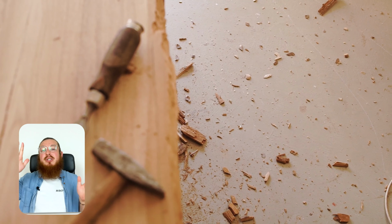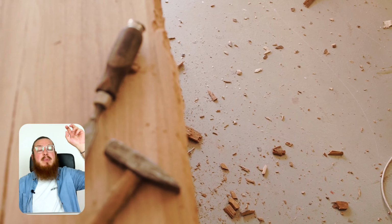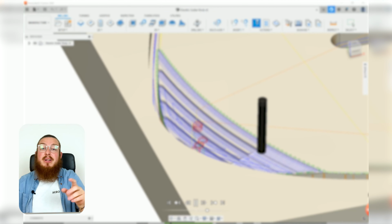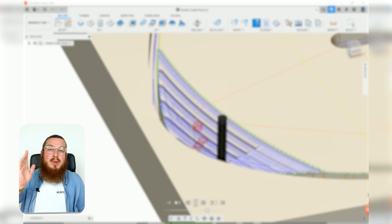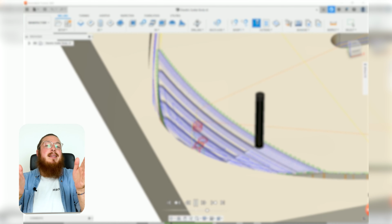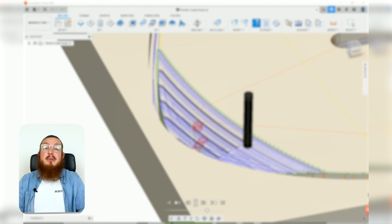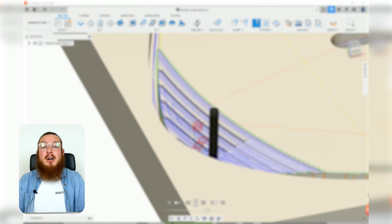You can find really large spreadsheets where it'll say, oh, well, I'm cutting with a 1/4 inch diameter end mill into soft material, and it's going to give me a rough gauge between 7/1000 of an inch and 9/1000 of an inch. We're going to split the difference and multiply it by 0.008 inches. Then we'll be multiplying it by the amount of flutes on our tool.